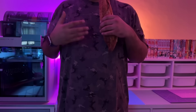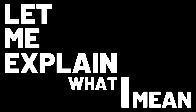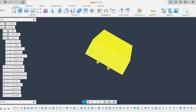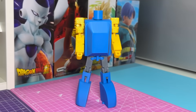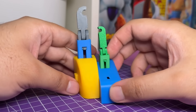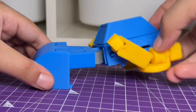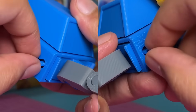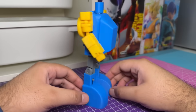So to fix that, our best bet is to look inside. We need to remove this volume from the torso and turn it into a shell, which will act as the new housing for the pelvis and the legs. After some quick prototyping, here's what the new transformation looks like: the lower legs don't slot into the feet anymore, which means we can make the front end shorter and more accurate to the show. The telescoping mechanism remains the same, but the legs now slide up into the torso. For robot mode, the lower half slides out, then these pieces turn 90 degrees to lock the pelvis in place. And the best part — no backpack.